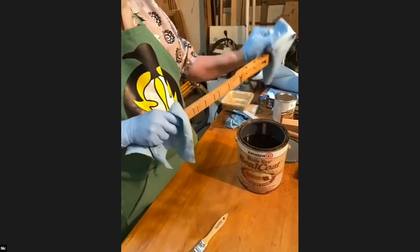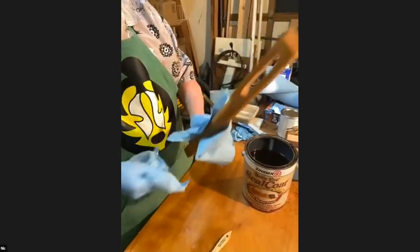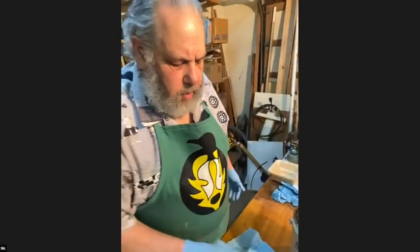Question about bleeding out after wiping the first coat: shellac doesn't bleed out. With oils, certain woods will bleed out, but if you use straight oil with no solvent thinned in, you'll have almost no bleed-out problems. Same with straight varnish right out of the can. The problems come when you try to thin it — that's when most bleeding occurs. So don't thin the oil and don't thin the urethane, and you won't have bleeding-out problems.